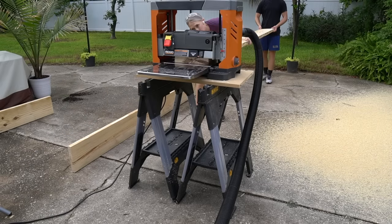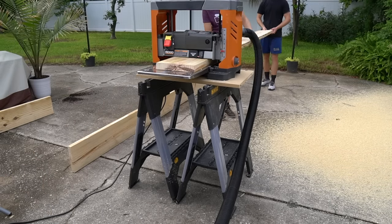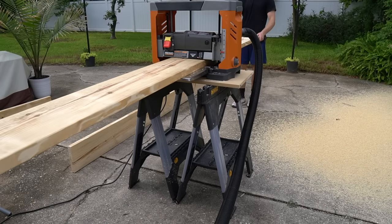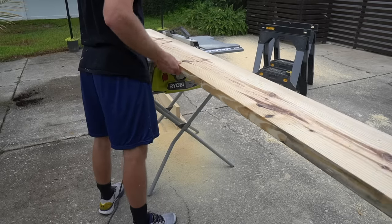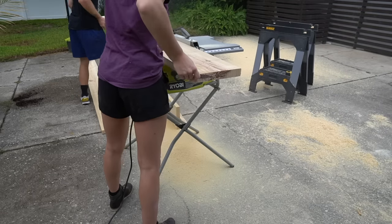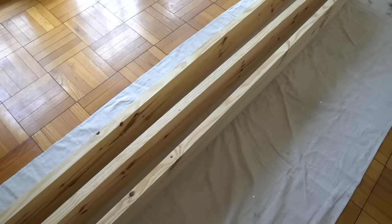This is my first time using the planer, and I think it's going to be a game changer for my DIY projects. I'll be sure to link the planer in the description below. After the boards were planed, we cut them to width on the table saw. Each board is about 8 5/16 of an inch, so my countertop depth is 25 inches while my cabinet depth is 24 inches.